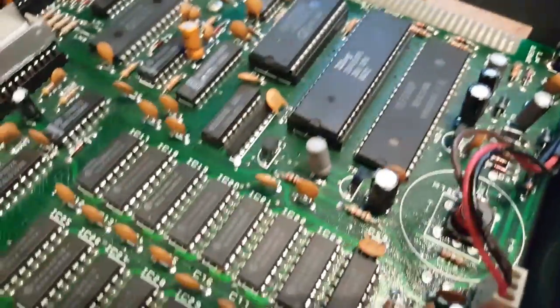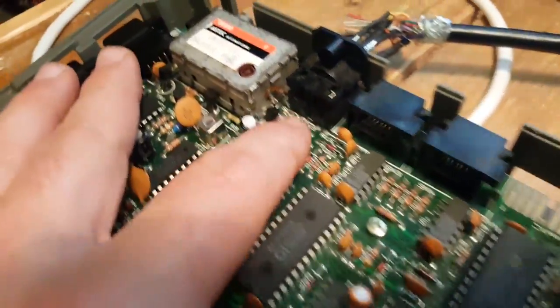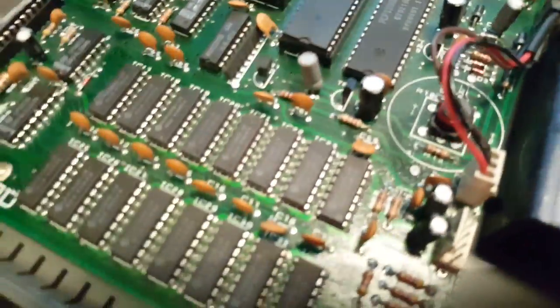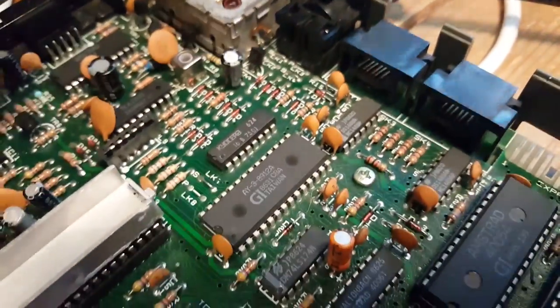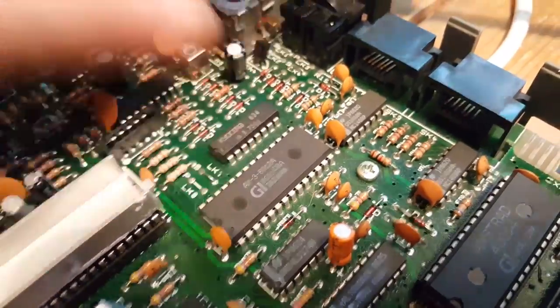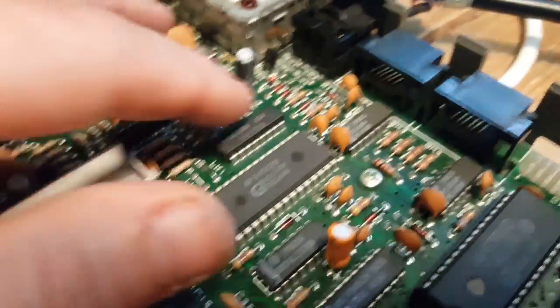Quick update: I rigged a quick RGB cable. Most people actually use S-video for this, but that comes at a price — you have to swap certain transistors. TR4, TR5, and typically TR9 are actually installed the wrong way straight out of the factory. The silkscreen on the PCB tells you which orientation the transistor should go in, but they printed it the wrong way. So when assemblers put the components in, they followed the incorrect silkscreen, resulting in things not working as they should. At the time, most people were using the RF modulator, so it wasn't a problem.